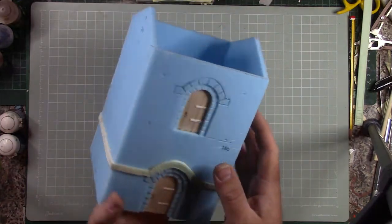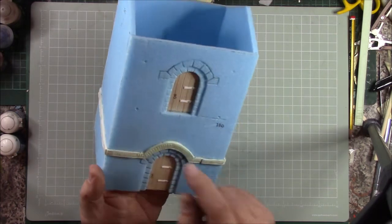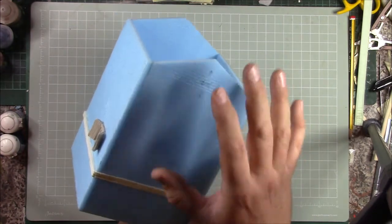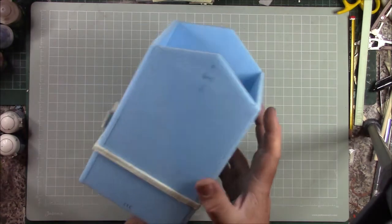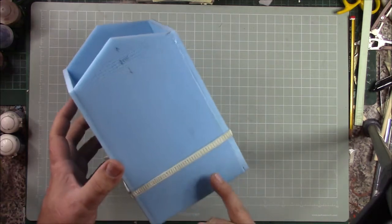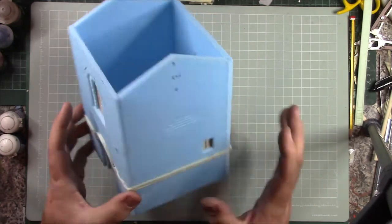You can see we've got some up there, and I'll probably add some in and around the bottom of the door. When you put your coating on, you leave those areas showing as they are so you can see the brick through. Another thing I'll do prior to putting the coating on is get some watered-down PVA and just coat over the areas where you've put the detail.